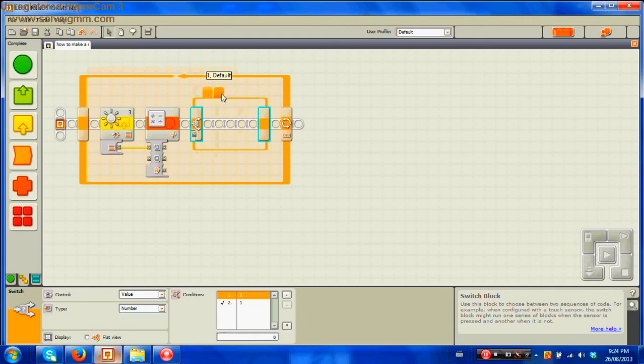We need to have five variables. Here's why: you're telling the robot what to do for five different cases of the light level. You'll tell the robot what to do when the light sensor is far to the right of the line, just to the right of the line, on the line, just to the left of the line, and far to the left of the line. By giving it these five different cases, it will follow the line smoothly. In the basic program it just had two cases — on the line and off the line — now it has five.